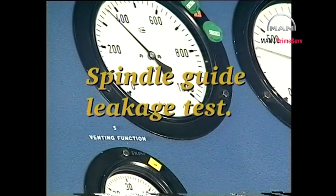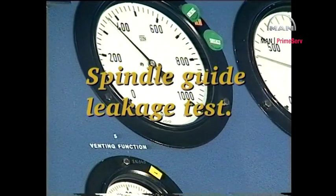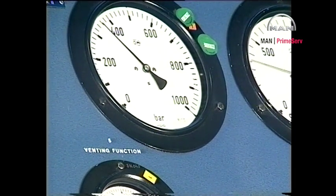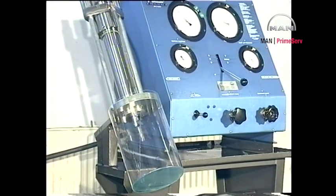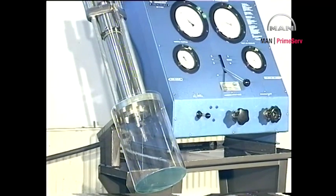Slowly increase the pressure until it is about 50 bar below the specified opening pressure. See Instruction Book Volume 2, Procedure number 909. There will always be a certain amount of oil flowing from the return oil pipe when the fuel valve is full of oil and pressurized.